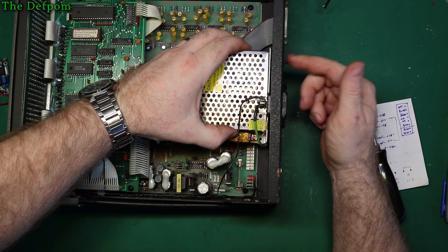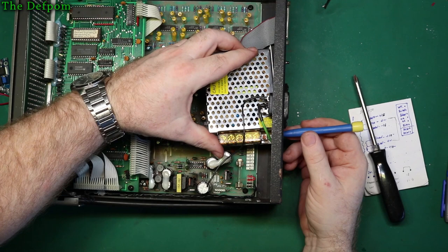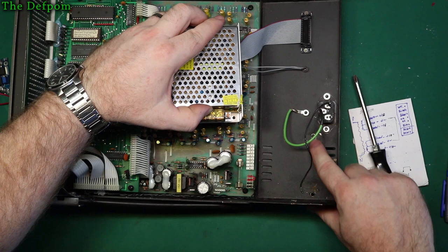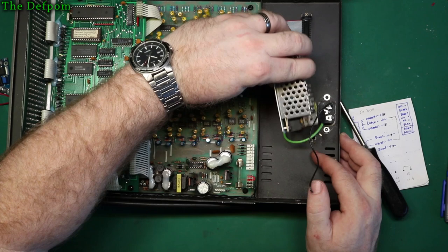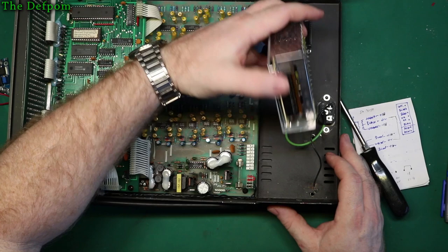And everything's still right there for me to work on. I've actually got that bolt hole there I can now use, let it line up. It's a little bit high. It's not quite in the right place, it's tipped over. Unless I elongate that hole. And I could just move that tag there, so you've got this chart I'm talking about. There's a hole right there, which the transformer was on before. So if I elongate the hole on the power supply, I might be able to use the same hole, and then just move that onto there and clamp it down. One less hole to drill, right? That's looking promising, actually. I like that.